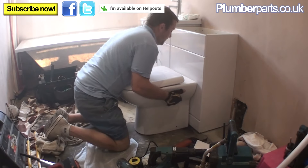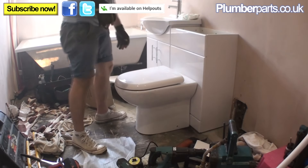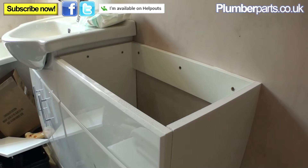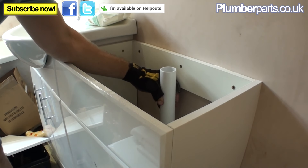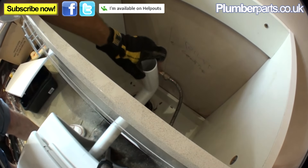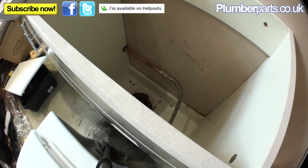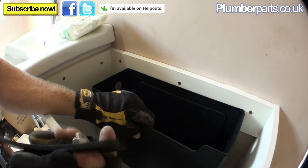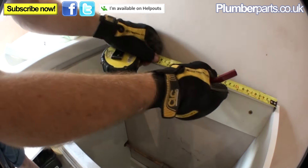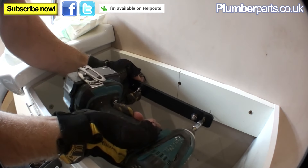You should be able to now marry up the loo and have a quick look down the side — there's absolutely loads of room for our fittings to go in. I'm just going to quickly put on the screws for the floor. Now we can concentrate on our flush. I know that this flush pipe can go pretty much this high, so we'll mop this up quickly. Our maximum flush height is pretty much in line with this pencil line here. We can hang our flush there — always take into account the actual height of the flush bit as well. I'm going to measure out my centre, which I know from here is 25, and get this central here as well.